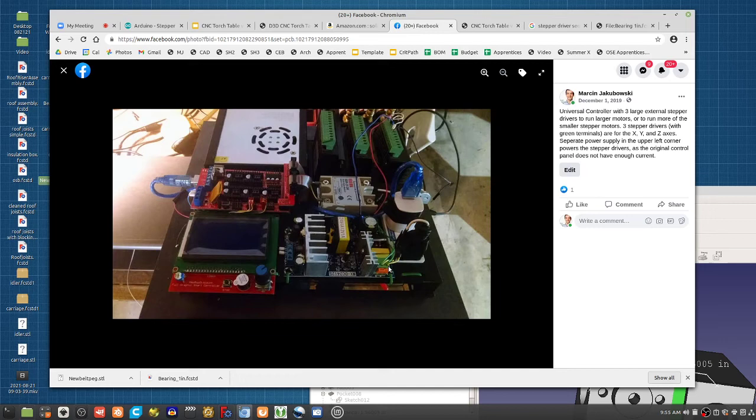Very cool. Yeah, with the LCD, you can program that to say, okay, now this is the torch table program firmware. That's for programmers, like anybody who wants to help us with that, we can do it. Otherwise, right now, just running Marlin, the G-code that you do for the two-dimensional motion, you can run this exactly with the Marlin firmware. You can run exactly the same 3D printer code, and you can be cutting out parts on the torch table. The LCD will say 3D printer, but you can readily change that to torch table and use the stock Marlin to control your torch table, things like that.